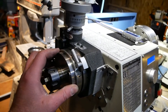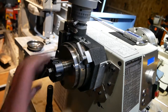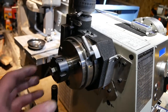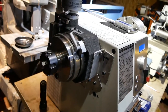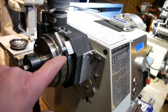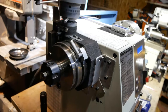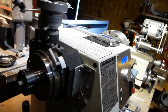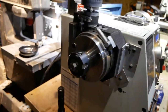This is an ER-32 collet that you mount on the chuck plate for your lathe. The lathe conveniently had a three-bolt pattern, and the rotary table had three T-slots, so I had to make some T-nuts and use M8 bolts to bolt it on. Otherwise it was a perfect fit. Getting it centered was a little bit of a hassle, but not a big deal.